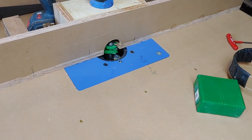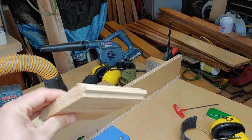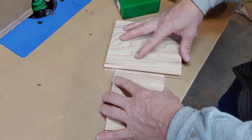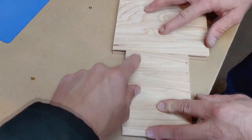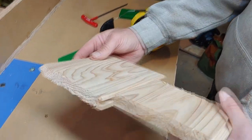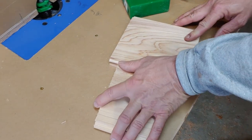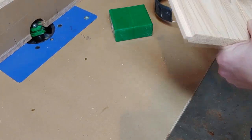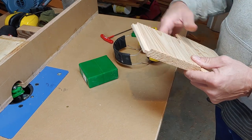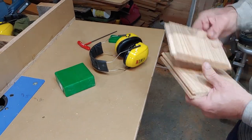I don't know if you can see the angle there. So it leaves a chamfer on it, so when you butt them together, if you don't have everything perfectly level, then you don't have a lip there. It gives you a nice finish V. A nicer, smoother transition. So you don't have to have the perfect lineup of the parts, or sand, because there's some warpage maybe in the board or a little bit of twist, or just little variation in thickness can change this. And so you'd have to be adjusting this constantly to get every one perfect that way. So this kind of relieves having to do that.